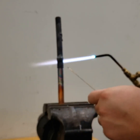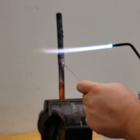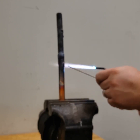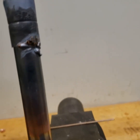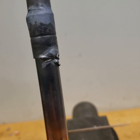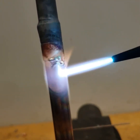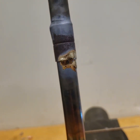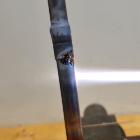What we see a lot of times is somebody bring the torch and the braze rod in at the same time and go like that. When I see braze on the side of a joint — just a bubble — that tells me the joint wasn't hot enough. All I'm going to do is come in with more heat, warm that copper up, and you can watch that braze just flow right into the copper. Your braze should be nice and smooth when you're done. There's a lot of braze built up right there — way more than is needed — but at least I know it's adhered.